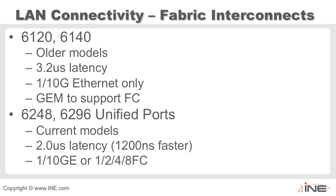If an ASIC controls two ports — as it does in the fabric interconnects — then you can only choose ports on an even boundary. For example, ports 1 through 10 could be Ethernet and 11 through 32 fiber channel, but you cannot split on an odd port boundary because of that two-port ASIC constraint.